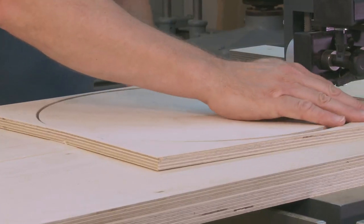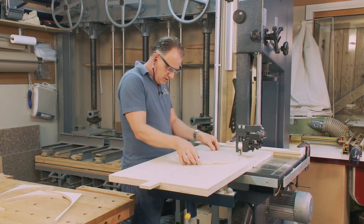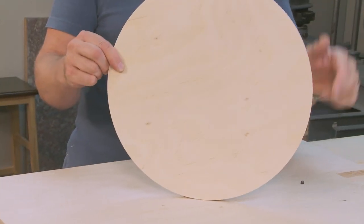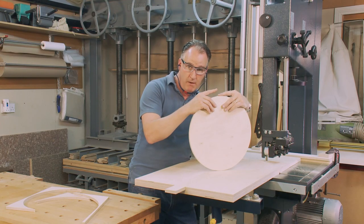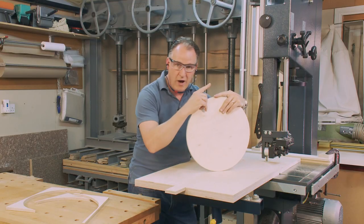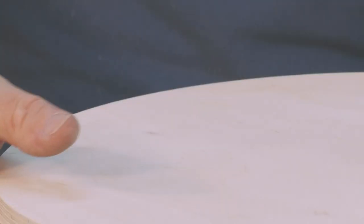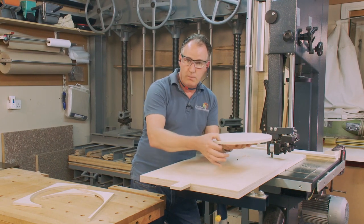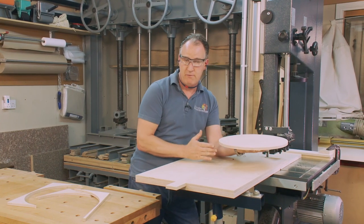That looks really clean. I can withdraw my jig back, take my disc off, and it really is a perfect circle. If you don't get that centre spot just where the front of the teeth are, you'll get a spiral and a lump - it will either cut smaller into the lump or out into a spiral. But that's really good, that's a really nice finish. I could use this same jig to improve this on the disc sander, route it on the router, or possibly on the spindle molder using this same jig, just having the slider bar in a different position.